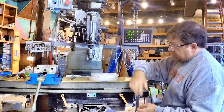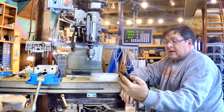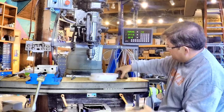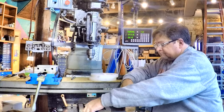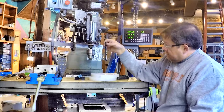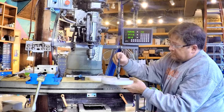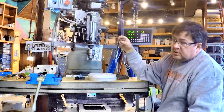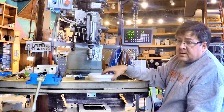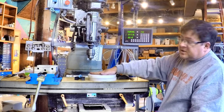And this is how we're going to hold it down, with these little rocker clamps. They look like rocker arms. Got three of these here. We're going to hold it down to the table with them, and then use just some studs and T-nuts, and then center up just by using the 5/8 inch drill. This is a 5/8 inch hole, and we're just going to chuck the drill into there and center up this way. That's plenty good. We'll center it up with the drill, and then go about bolting it down. We're going to space it off the table, just in order to be able to drill through and to keep the UHMW from getting real nasty.